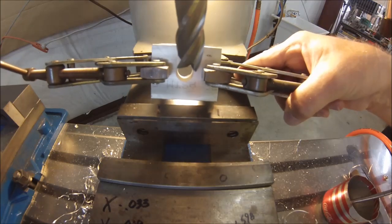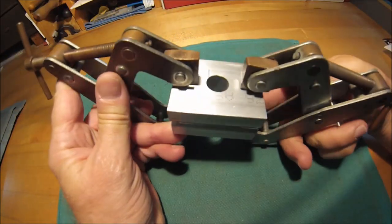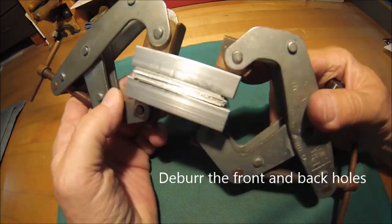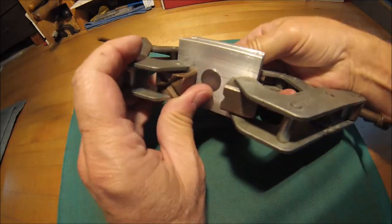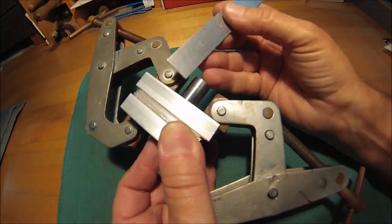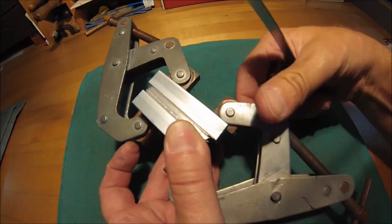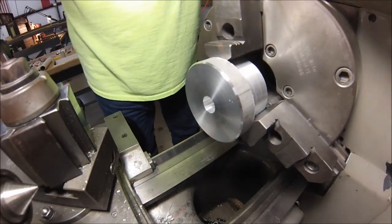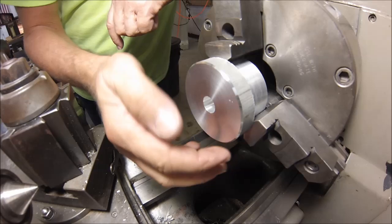If all went well, you should have a nice clean hole all the way through your part with the shims sandwiched in between what I would call sister blocks. Locate a pin that goes all the way through that fits really nicely, stopping about an eighth of an inch from the back of the part. I measured my projection and came up with seven-eighths of an inch. Let's go over to the lathe and take a look at how this is going to get turned.